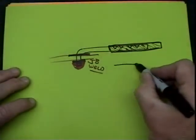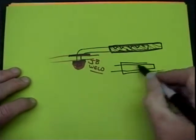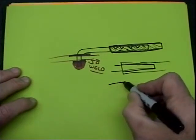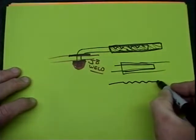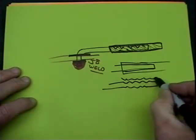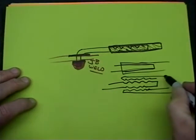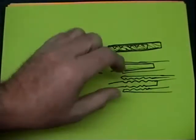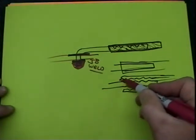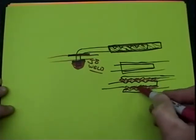In other words, if that rod, when it comes out to the end, is smooth and the tube it's in is smooth, that has a tendency to pull out. A better thing would be if it looked like this and the tube itself was rough. Get in there and scratch it any way you can. Roll up some sandpaper or whatever. Rough is always better. These are engineering upgrades that aren't going to be a real difficult thing to do.